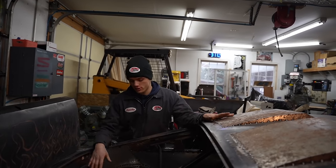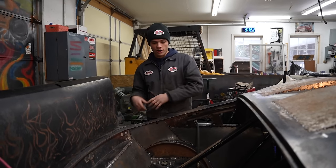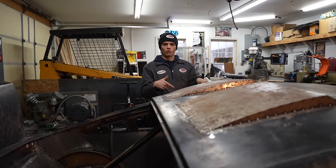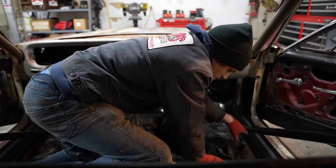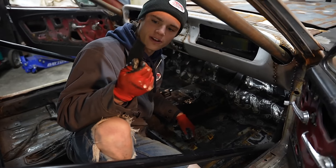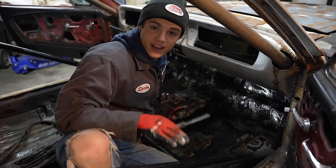Now that the scoops are finished and we have all these beautiful panels done in the car, it's time to prepare for paint. We have to do everything — I want to paint everything in this car, from the trunk to the interior to the inside of the roof to the floor. First thing I'm going to do is pull out the dynamat that's all old and scuffed up, and also pull out the shifter. The dynamat is very sticky — good for install, bad for removal. At the same time, I'm chiseling up the factory undercoating because it's retained a fair amount of moisture underneath and it smells really gross, like a sewage fish pond. That'll help the car have a nice, fresh start.